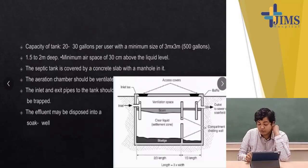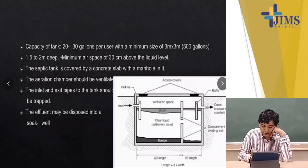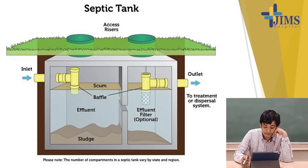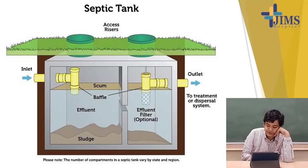This is how a septic tank looks like. The length is around 3 meters and it is 1.5 to 2 meters deep. The inlet goes inside the tank where sludge is deposited. There is a clear liquid zone from which clear water is collected and then exits through a pipe to the outer sewer area. Access covers are placed at every 100 meters. There is also a pipe from which air can escape from the septic tank. Key terms to know: scum, baffle, effluent, and sludge.